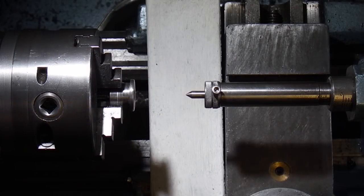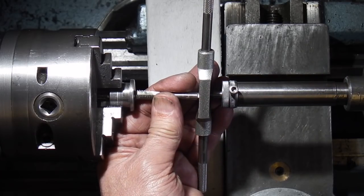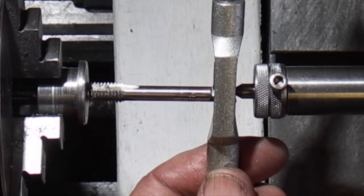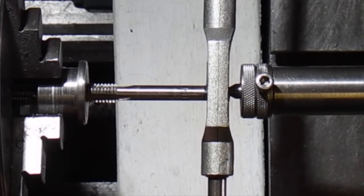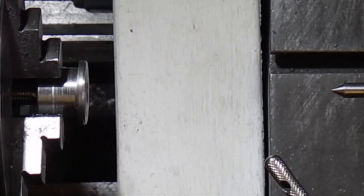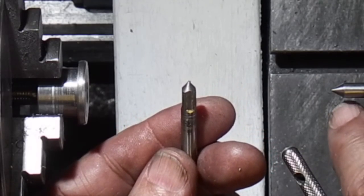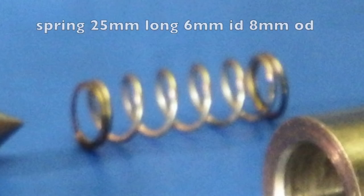Return this into your holder, put the tap in the hole, bring the holder in at the end, and as I turn it in the plunger goes into the bar. That's spring loaded, so as I tap the thread and the thread goes in, the plunger will come out. You can always wind this in a bit further if you need more tension. If you have taps that have got the male end, just swap the plunger around and use the cone. Here are some details of the parts used. Well, that's it for today — I hope that information is useful to you, and we'll see you next time on E-Nuts Engineering.